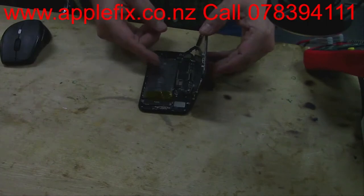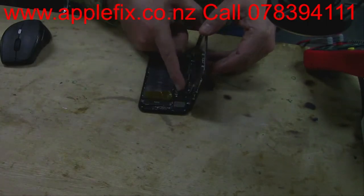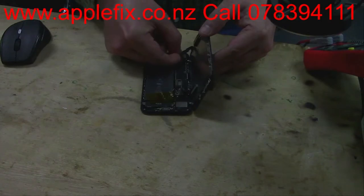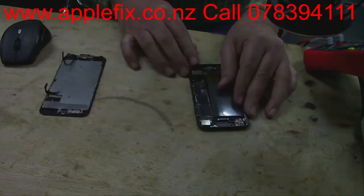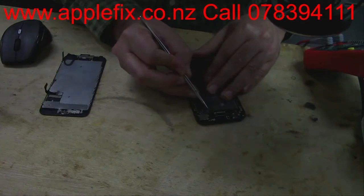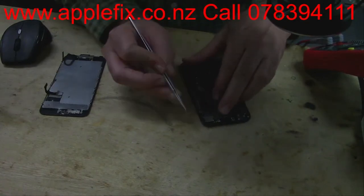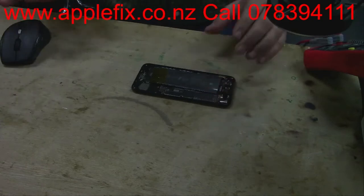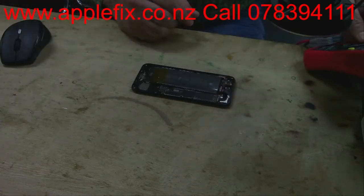So what we will do - I am not going to disconnect the battery. The reason behind is I would like to check the voltage lines on the rear camera FPC connector. I will disconnect the rear camera connector, and there are two ways to check: either you check in diode mode reading, or check the power lines with the multimeter.